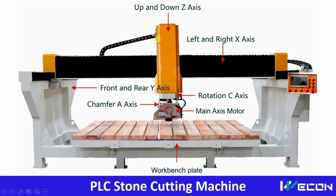It has its own motor, and here you can see this is the flexible cable arrangement, because here there will be the Z axis motor and the X axis motor will be touching this platform. So if the motor rotates, it will move this assembly in the right or left direction. And this is the flexible cable, because this assembly has to move anywhere, so the cable also moves along with it. Here also, if this assembly moves backwards, that is the Y axis direction. It can move backwards or come forward. So these are the cables for the Y axis.